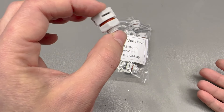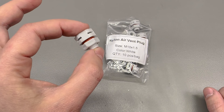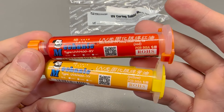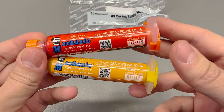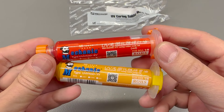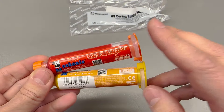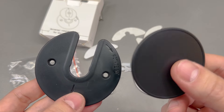Since I've started doing some outdoor installations with the LoRa gateway project, I grabbed a few of these breather valves. They're just above what I'd call cheap on AliExpress, but I thought they might come in handy. I don't have a lot of experience with outdoor installations and I'm not really sure when one of these is required. The electrical box I used to house the LoRa gateway has a seal and an IP65 rating, but it also has four mounting holes that I drilled to attach it to the wall, so it can breathe through the tiny tolerances between the hole and the screw. Maybe there are scenarios — like a pressure sensor inside a tightly enclosed case where you want to measure outside pressure — where this type of valve helps while keeping water out.